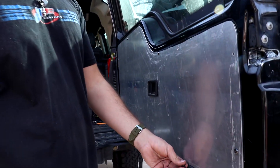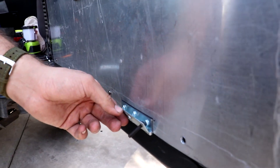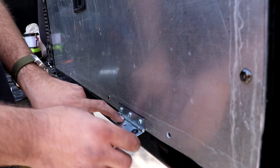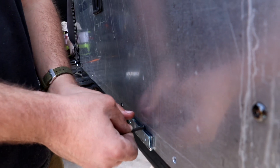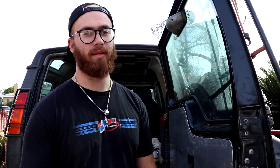We're running into a little bit of a problem we didn't think through. The bolts we got to screw into the wood — when we put it in the hinge and move it up, this doesn't want to close. We hadn't thought of that. So now we're just going to make new holes over here so that when this is closed, it still fits inside the little groove perfectly. Let's go make new holes and fix our problem.